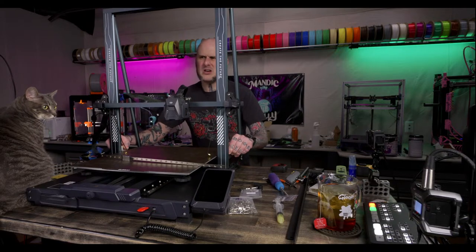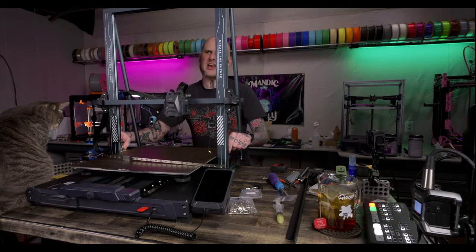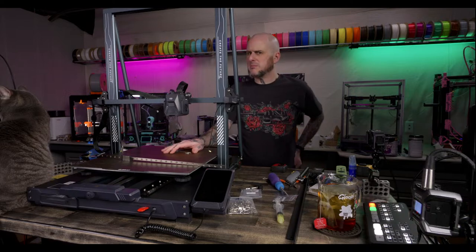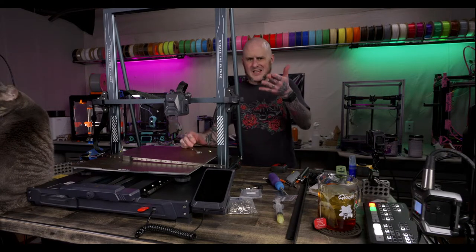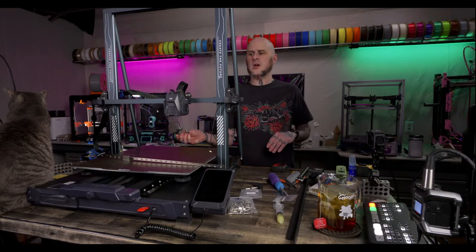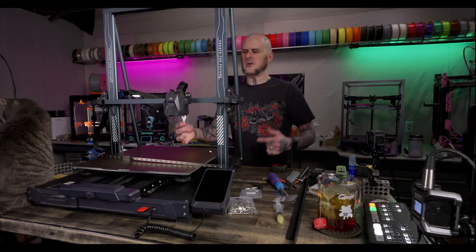If I get the Fabrico edge-to-edge heater rated at 600 watts, should I get the higher spec PSU? The edge-to-edge heater from Fabrico is probably AC mains voltage. Not knowing exactly which one you're talking about, it's probably AC mains voltage, and you won't be running it off your power supply anyway. It runs off an SSR and directly off of your wall power.